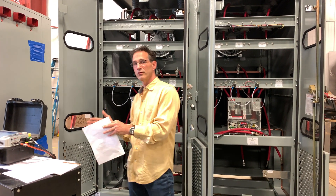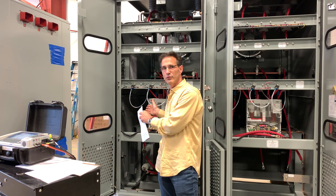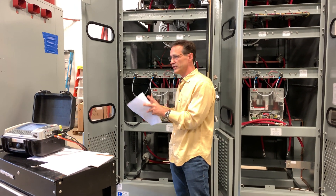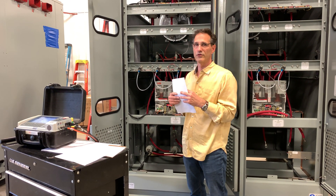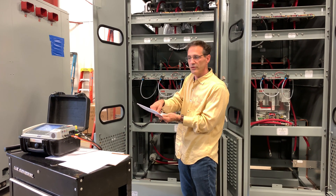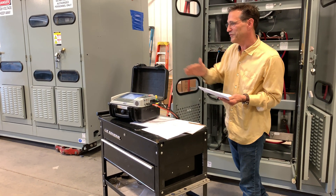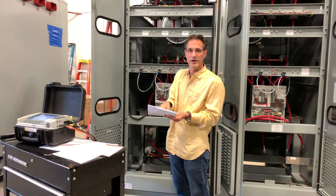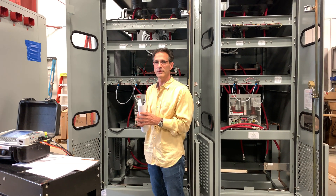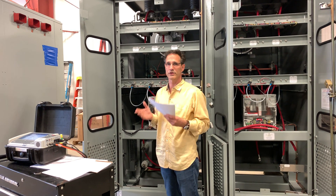We make these test results available to our customers. One of the key reasons we do that is that at some point in the future, if the filter bank were to go through some type of failure — if the windings were to shift inside the iron core reactors, or the capacitance were to change — we would get a shift in the frequency response of this harmonic filter. In a sense, we're taking a fingerprint of the harmonic filter at the plant and making this fingerprint available to you. You can then use the same device, the Frax 150 by Megger, and confirm that fingerprint at a later date. If it has changed for any reason, you know that something has happened to the harmonic filter. This is a test often not conducted by most suppliers of harmonic filters, but Northeast Power Systems has felt that this is a very important test in our outgoing inspection, and we conduct this test for that reason. Thank you for watching.